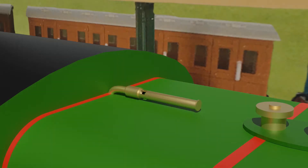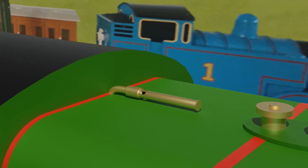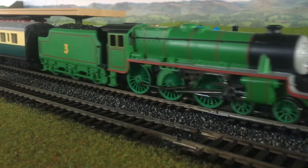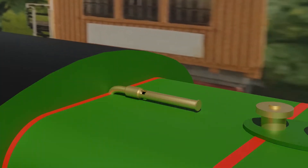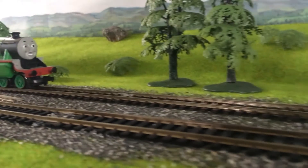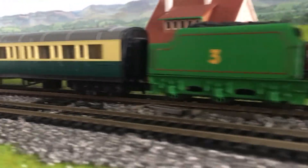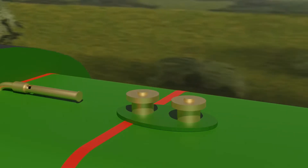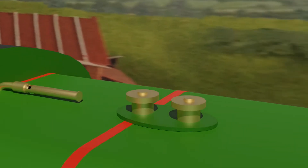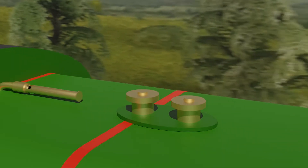The thing that just made a noise is Henry's whistle. The steam pressure in the boiler can also be directed to the whistle. The whistle lets off a toot to signal different meanings — these signals are almost like Morse code to tell other crew, signalmen and stationmasters what is happening to the locomotive. In front of Henry's whistle is what's called a safety valve. When pressure in the boiler is really high, the safety valve releases steam to bring the pressure down, which stops boiler explosions.